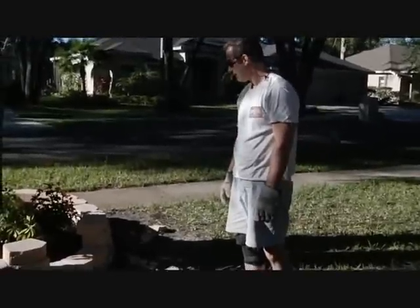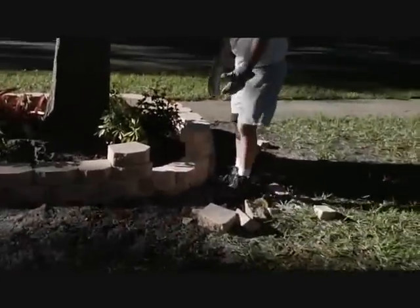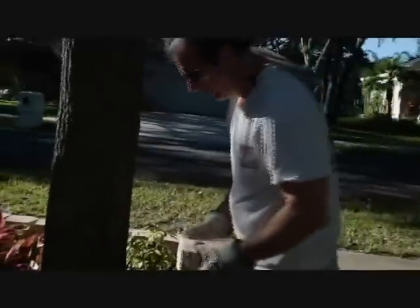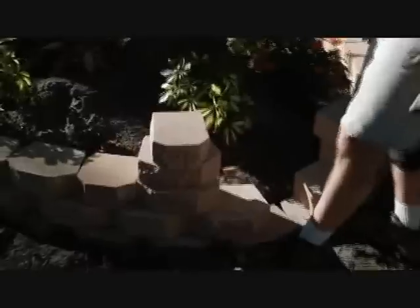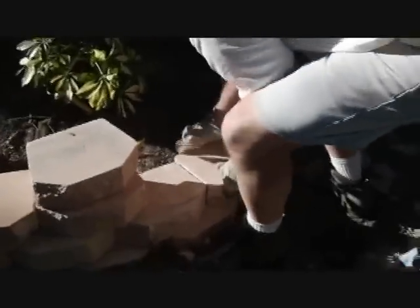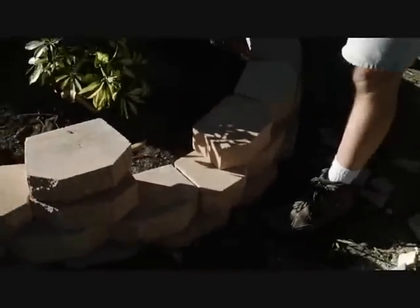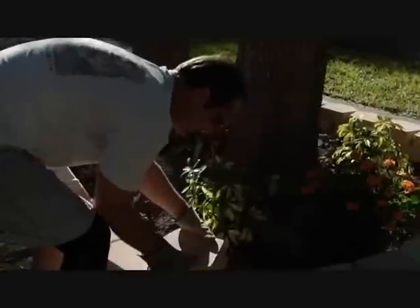While we're at the end of the block-setting phase, as you can see this one — I had to take a lot off and it fits pretty close. I used the scraping method with another block, tapering off the edges so they kind of match. It's not so obvious that it was actually broken. If you do a project this big, you're probably going to have to cut four or five blocks like that, and you'll get good at it. I got one that messed up — did a really nice one on the side, but this other one took too much of a bite. So I just started over. Buy some extra blocks and save yourself the headache. Make sure you keep everything clean so you don't mess up your hard work keeping it all level.